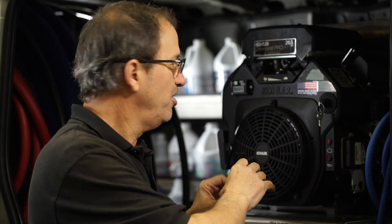I think it's very important to prep your truck for the next day's workload. On the way back to the shop, go ahead and gas the truck up. When you get back, wipe the machine down — by making it look good, you deliver that positive moment of truth the next day. Make sure filters are clean and your freshwater tank is full, because maybe you're going to a house that doesn't have water the next day. Also go ahead and dump your waste tank in case you can't dump at the next location. Make sure all your chemicals are full, everything's inside the truck, and you're ready to go — it starts the day off on the right foot. Make sure you're on time to your first client.